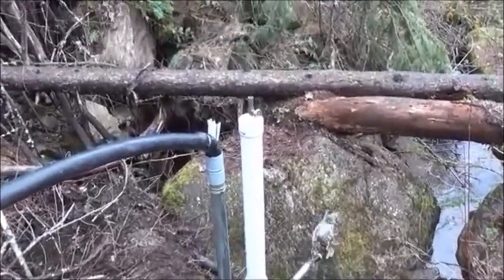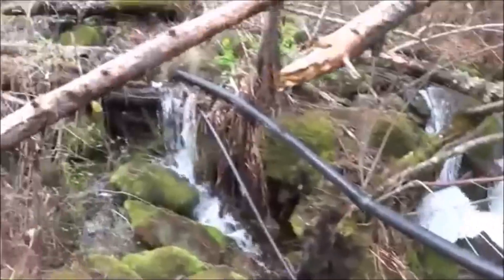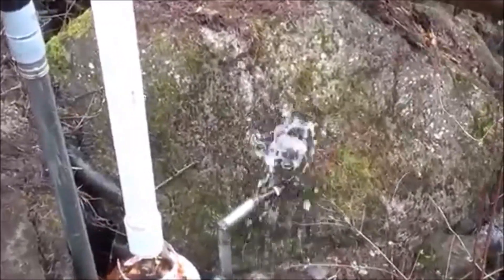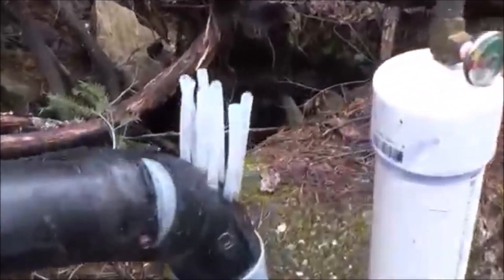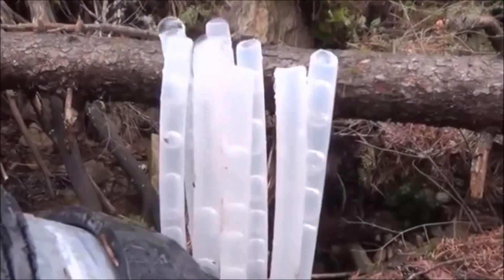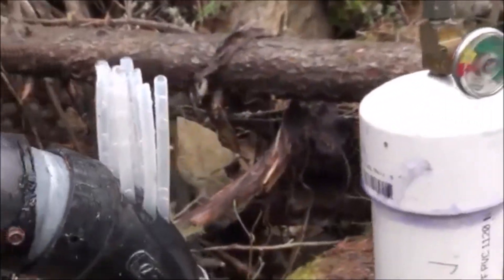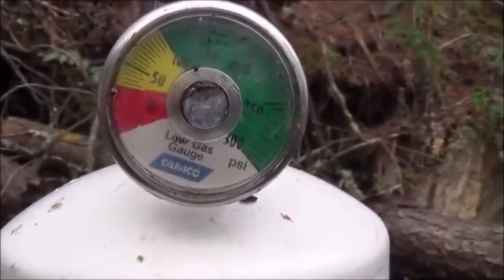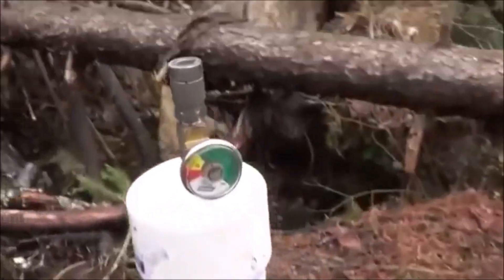So there it is running, folks. We're drawing air in through the straws. You can see how fast the cycle is happening. We're building up air pressure through our Tromp hammer design, with the pipe running way uphill. Not a lot of lift at the moment, but this is just a good test. Sorry for talking so loud — I'm by a river, it's very loud out here. Let's go ahead and look in on the valve here. That is a very high velocity. We're already building pressure in the system. If I get up close here, you can actually see the air bubbles inside the tubes — the little gurgling air bubbling action happening there. Every time the valve's shut, the little bubble pops back up. So our Tromp hammer is working, folks. Right now, if I come over to the air pressure gauge, it's very difficult to see that needle — it's bouncing so much from the vibration. We're starting to get up in pressure. I just turned this on, so let's let it run for a moment and see how much air pressure we can build.